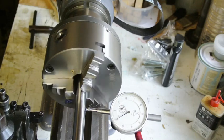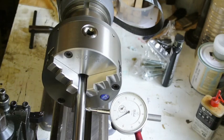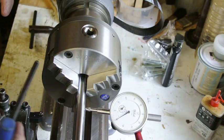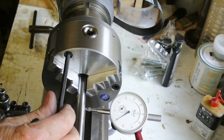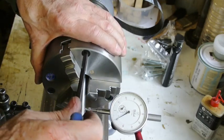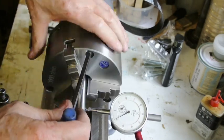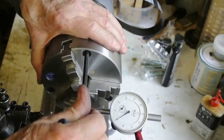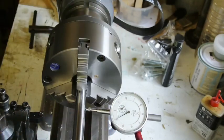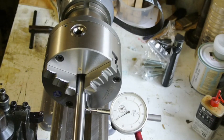As you can see it's quite possible to get well within 0.01 of a millimeter of accuracy right close to the chuck. That's now ready — just snug these up a little tighter, hoping it doesn't disturb it too much. If anything that's made it better, so that's well within 0.01mm. That's a good illustration of what good results you can get with something that cost only just a few pence to put together — a very small alteration to the chuck as purchased.